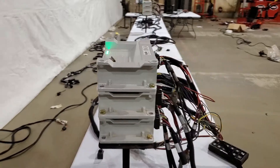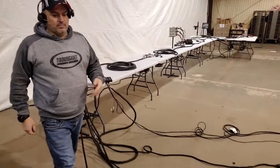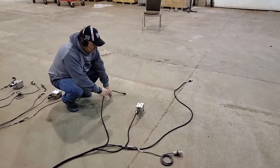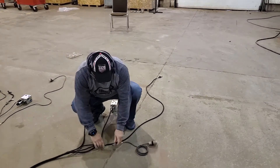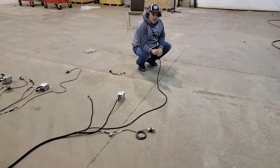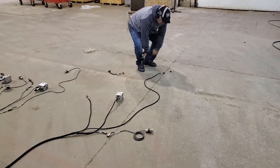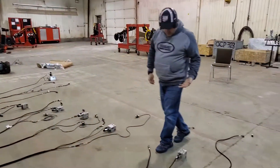Now what we can do is go back and unplug the sensors on that harness. We'll go back to where our sensors are plugged in. You're going to have a speed sensor at the end of your metering auger — unplug it. Unplug your bin level sensor. And on a 9000 or a 7000 fifth tank, make sure you unplug the pressure sensor for that tank as well, because it is a sensor too. The BWM isn't a sensor — it's just a control, so it doesn't need to be unplugged.